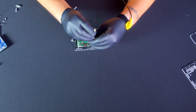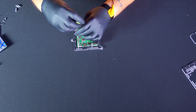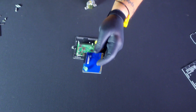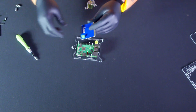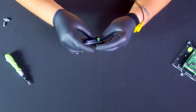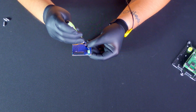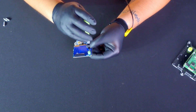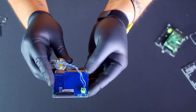Place the Raspberry Pi board onto the four standoffs and secure it in place with four additional metal standoffs. Then get your blue Raspberry Shake board and attach the GeoPhone sensor cables to the back of the board. Insert the sensor cables into the holes as indicated, ensuring the grey cable goes into the hole marked with the positive sign and the blue cable into the negative sign. Secure them in place using a fine point Phillips screwdriver.